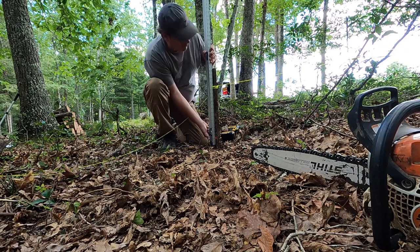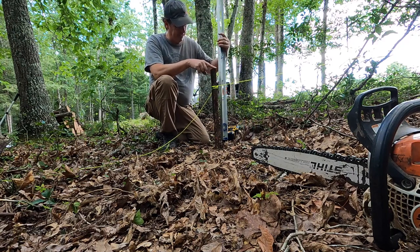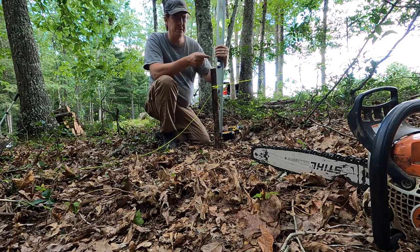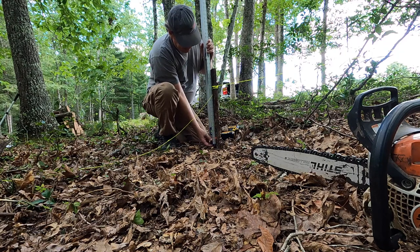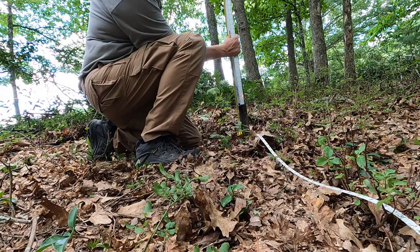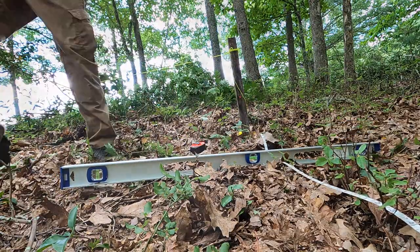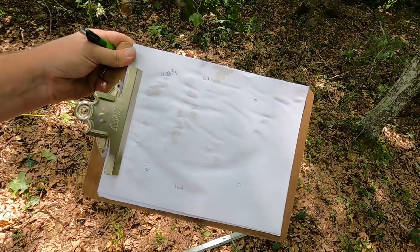Using the laser as a reference, 20 and a half is our magic number. That would put the base of the floor right at the top of the stake — roughly a 22-inch crawl space. So going to our four stake points, the back low corner is reading 28 and three-quarter inches. I'm just writing down each stake position and the height to give me a reference to start with.